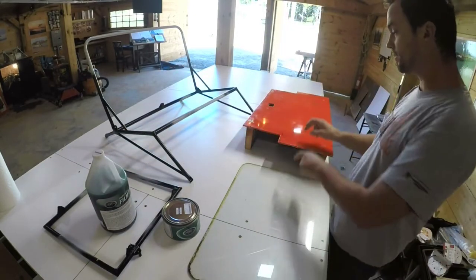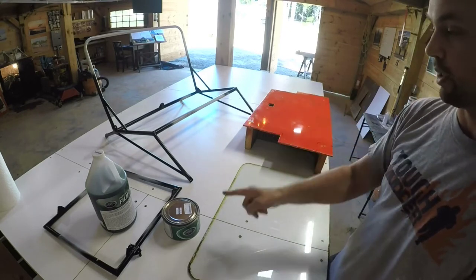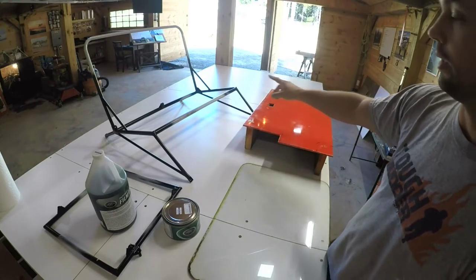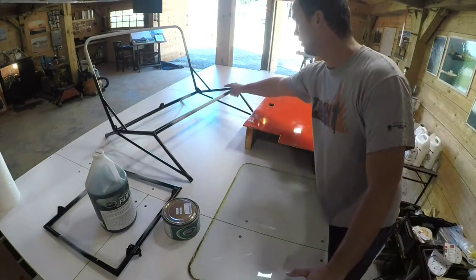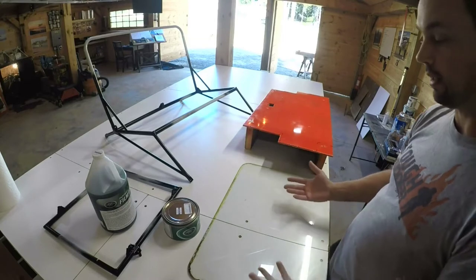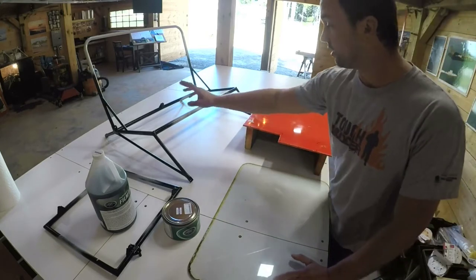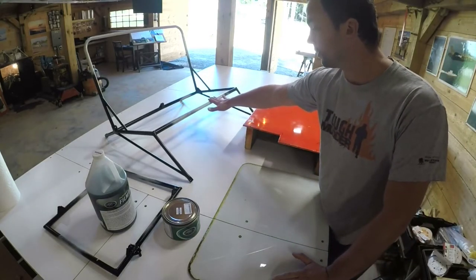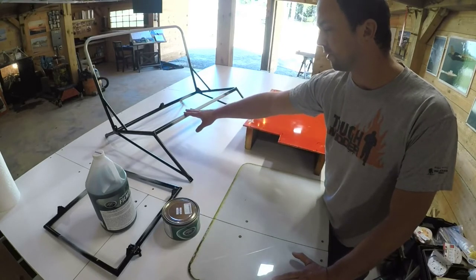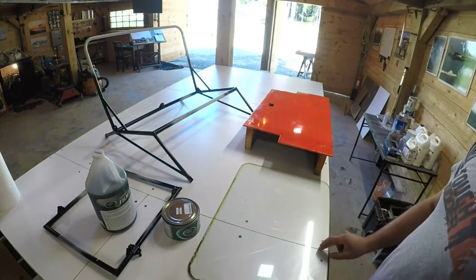After the wax I'm going to follow up with a PVA release film — both on the glass and on the mold. Once I've done that I need to do some templates and get all my carbon fiber sheet prepped. I am going to do a carbon fiber wrap on four sides of each frame, let that get tacky, and then do the layup on the molds and fold them in. That way I get rid of any hardware that would be needed to screw or rivet panels in — it'll be a more secure connection and less weight.